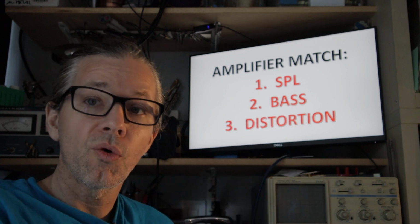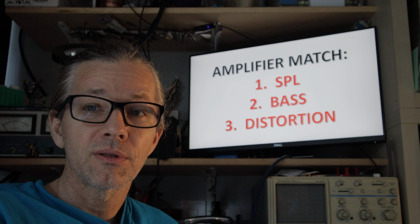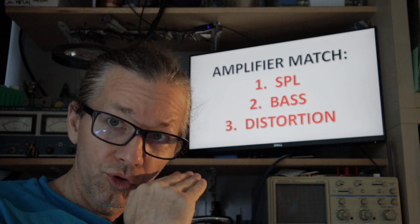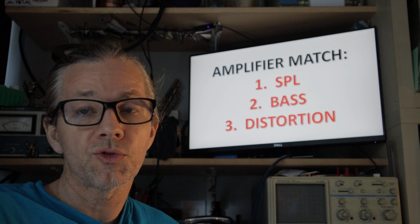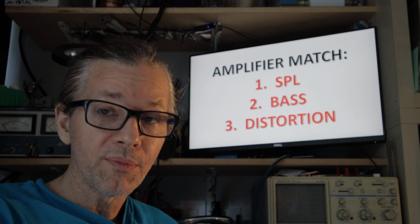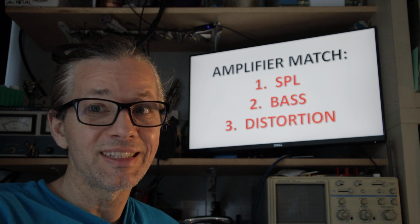As far as distortion goes, it works differently with tube amplification and with solid state amplification. It's more complex than this, but if we totally oversimplify it, and that's going to incur a lot of exceptions, with solid state, when you have distortion, it's a harsh distortion. It means that the more your amplifier distorts, the harsher the sound gets, and it will cause listening fatigue. And for tube amplifiers, the more distortion you have, the softer the sound gets, and it will feel like you are getting a looser sound, but it's not giving you listening fatigue.